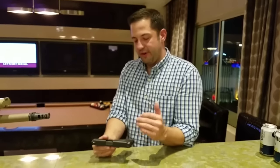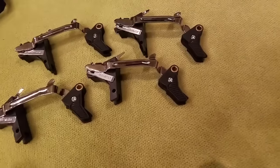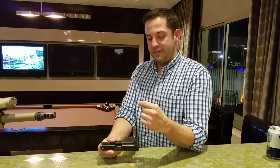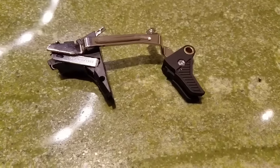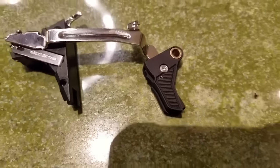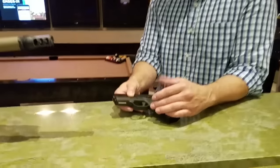Here are some pictures — you can see it has the oil-impregnated bronze bushing. We have to pressure-fit that in; it's almost brazed in. We've got a custom short shoulder screw — that's stainless — and an additional set screw, also stainless. Those aren't adjustable set screws. The back of the trigger has a very thin slit — thinner than normal. We spent a lot of time figuring out exactly how wide that slit needs to be for the right max pre-travel and minimum over-travel. Some take-up is just physics, and some is worked in there in case the gun is super dirty. But that can only be done by wire EDM — it can't be machined that way.